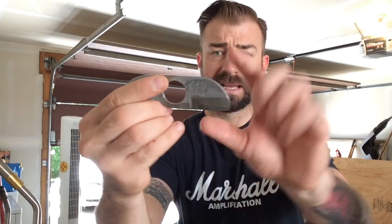The issue with completing the M-Tuck was that the steel is so thick and because it's a short blade, the angle had to be very abrupt. What was happening is as I was putting the bevel on, it was running into the side of the blade. Let me cut over to the belt sander and show you what I mean.